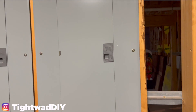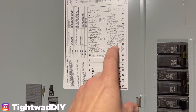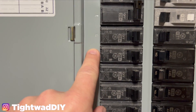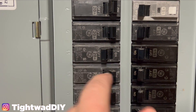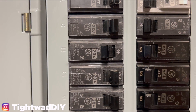Locate your main power panel for your home. Your outlet should be clearly labeled here, but you can't always trust the writing. Find the one for kitchen receptacles — it is number 11. I'm going to find the odd ones on the left and flip off number 11. Now we'll go test the outlet to make sure that our breaker box was labeled correctly.